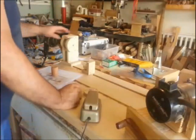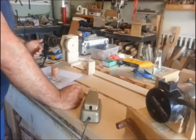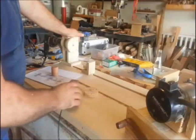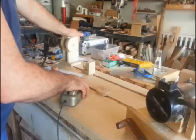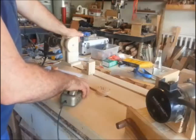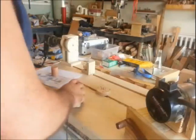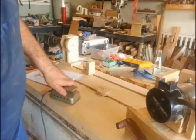One of the things I wanted to show you is that this drill is variable speed by the amount of pressure you put on the trigger, but since I'm locking the trigger in place it's no longer variable speed — it's just high speed. So I found this old sewing machine that someone was throwing out because the machine was broken, and I wired it up through the pedal so I can get low, medium, or super fast speeds. Then I can put a bolt through here and make it adjustable to control the speed quite accurately — a neat little trick to make your lathe variable speed.